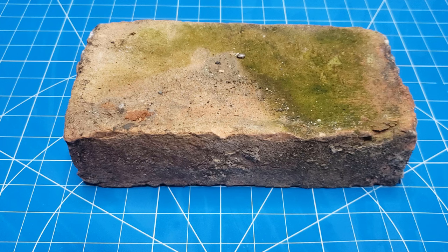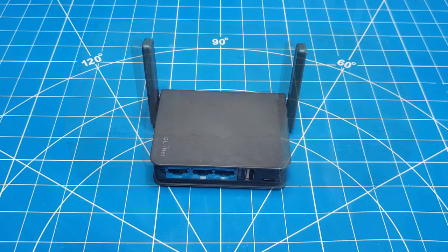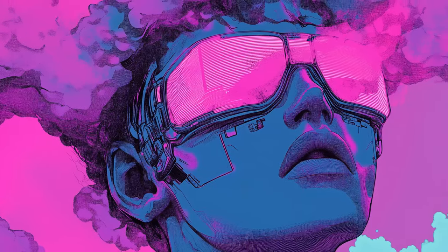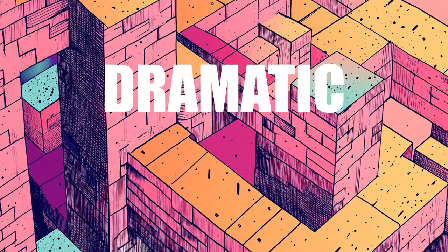I was able to resurrect a Slate brick in this manner. Please note that if you attempt recovery mode after successfully flashing Pineapple firmware, this may have the opposite effect of recovery and instead brick it. Another method is to transfer the firmware via TFTP and flash it. This method was not suitable for any of my many bricks, so nonetheless I am going to create a dramatic enactment.